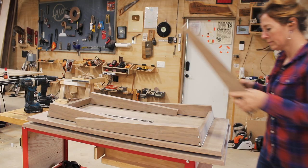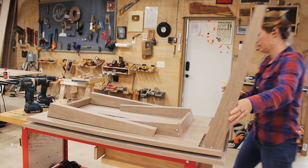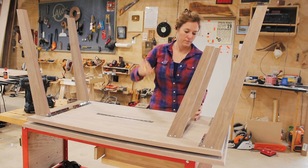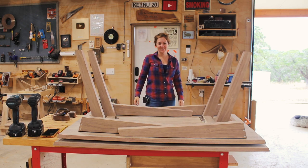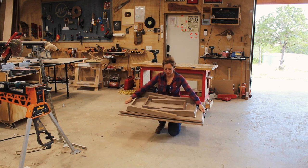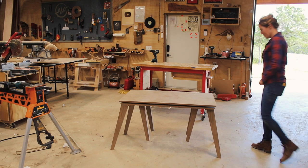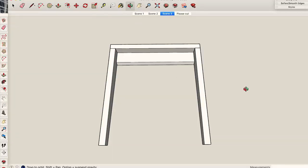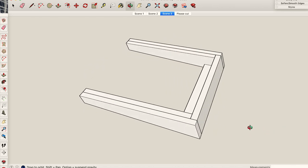My idea — which seems simple but turned out to be quite tricky — was for the fold-up pair of legs to blend into the design. I want the function of being able to make it tall when needed, but I want it to still look great as a lower coffee table since I imagine that's where it will be the majority of the time. I love the way it looks with the tall legs folded up. After getting all four mounted I flipped the table over to see how it looked and felt. I loved the look but it was a tad bit shaky when in the tall position. To fix that I completely remade the legs with a slightly different design — I half-lapped in one of the rails then actually added in a second. It has to be small because everything on the underside is already a tight squeeze, but these changes made a big difference.